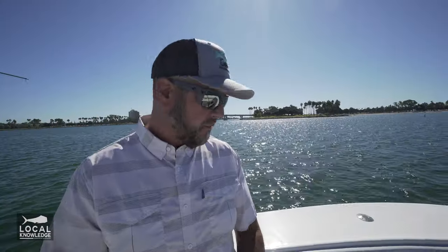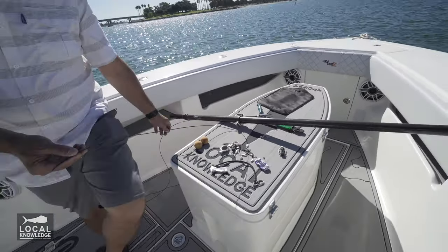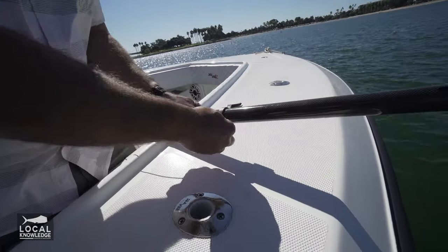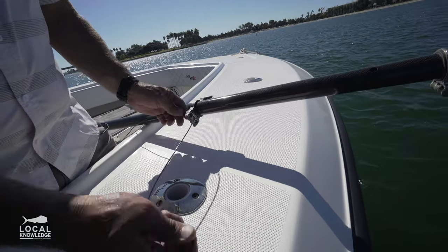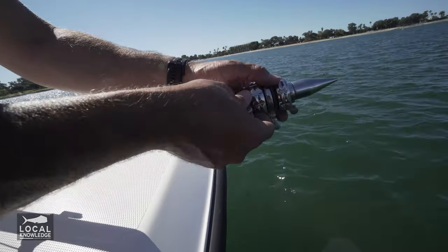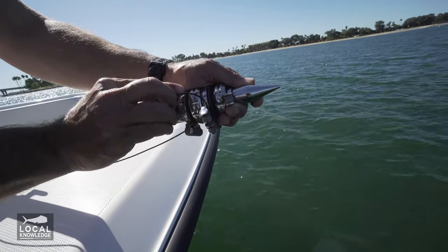For the first step, I'm going to run my line through my riggers. I'm going to run my long line first, which is the one that will go all the way to the tip of the outrigger. In this case, this is going to be from my starboard side. I'm going to put this through the back roller, going through every roller until I reach the single roller at the tip.